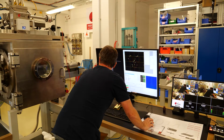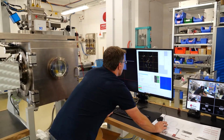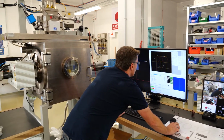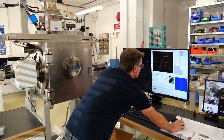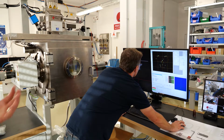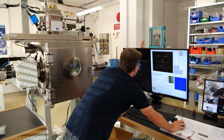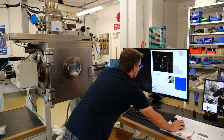The optical camera can be used during welding. However, there's a protection window inside, right? We have a shutter. It's now shut in order to protect the window. The window protects the optics, but the shutter protects the sacrificial glass. The glass is an ITO-coated electrically conductive piece of glass, which needs to be replaced from time to time. It protects the entire prism, the optics, which is directing the picture to the camera.